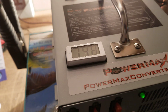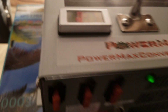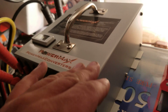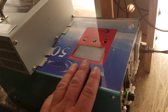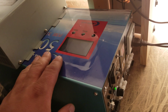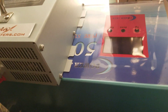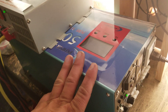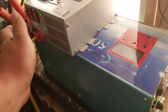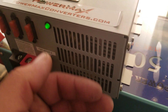Two of these in series gives you a constant voltage — you can adjust the current. They're pretty much the same unit; it's a fixed output, three-stage design, and it also acts as a battery charger. Anyway, that's how I load test these inverters. This particular customer was complaining that the inverter was shutting down with a light load — I define light load as about 10 to 20 percent — and so far it's been running for about an hour without any problems.